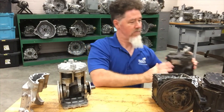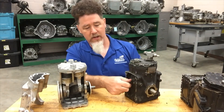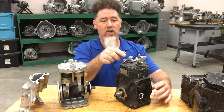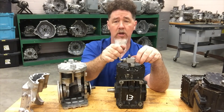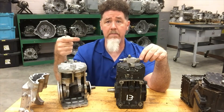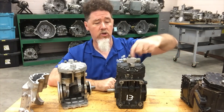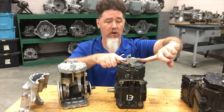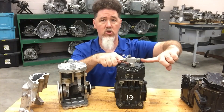I have another compressor over here — it's an aluminum compressor and it has the screw to check oil. So before you open that up, you have your service valve. The service valve is going to be in three positions. Right now, in normal operation, the service valve should be all the way backed out — they call that the back seat position. In this position, refrigerant can go into the compressor or come out, and the hose and the compressor are connected together.